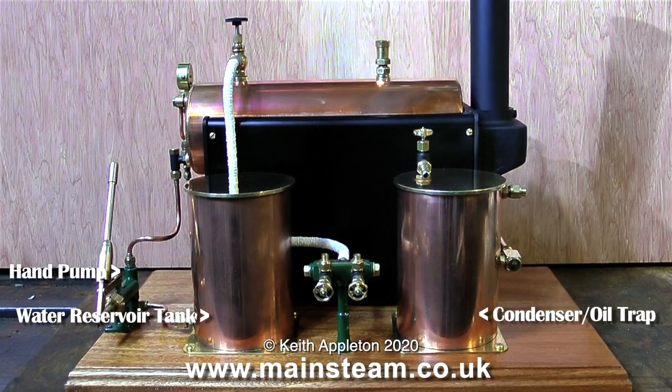A lot of viewers tell me I should use deionized or distilled water in my steam plants. This, however, is nonsense — I use tap water from the tap, and every so often I clean out the boiler and use some kettle descaler. This small but essential unit between the two tanks is a steam turret — all it is is just two valves on a mounting, often fitted with whistles and sometimes displacement lubricators.